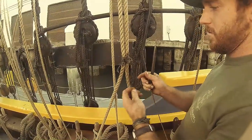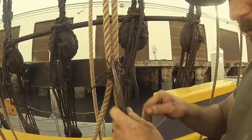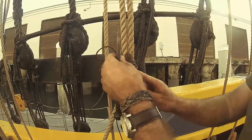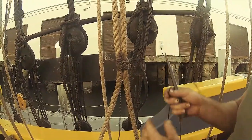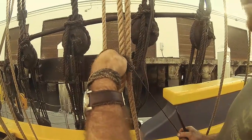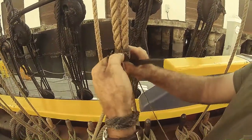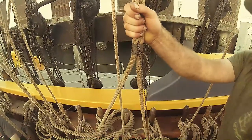Once you get to the finishing point where you're going to make the knot, put your tail up through the first puller and pull it out to the left — that pulls it from between the two strands out to the left. This is the important part: the tail goes through the second puller, but the tail needs to come out underneath the bite of line. If it goes on top, it doesn't create the same knot. Take as much slack out of the seizing twine as you can, put your spike through, and pull it down. This creates what's called a flat knot.